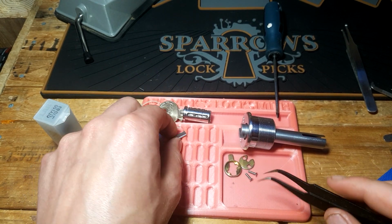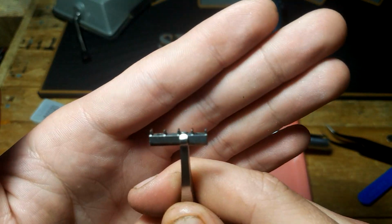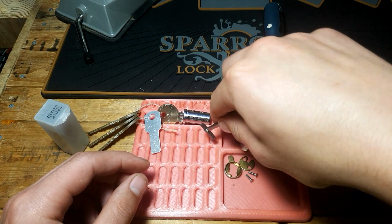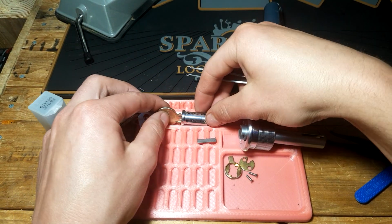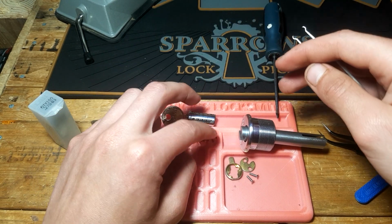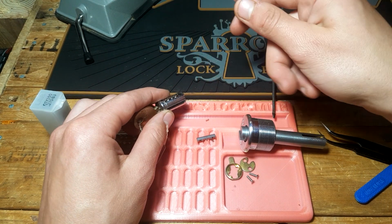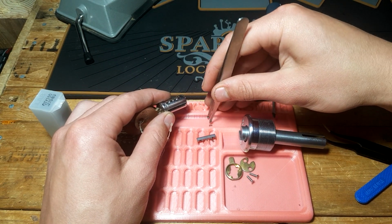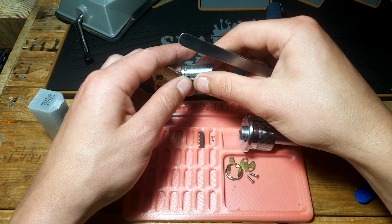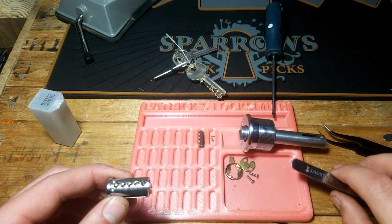So, as you can see, this lock is good for 5 pins, but it only has 4 in it. I'm going to be leaving him up top here. And there are the springs, 1 and 2. Those are something you do not want to lose, these little springs. And since this lock isn't worn, they came out pretty easily. Sometimes they have a hard time coming out. So I'm going to take out the key now, put him aside.